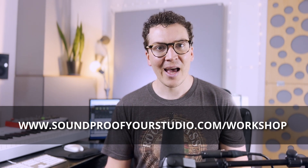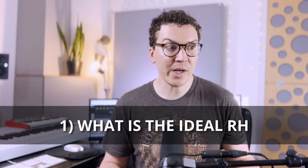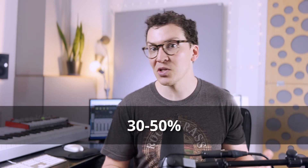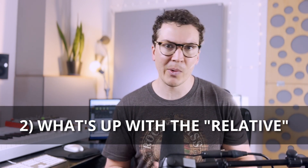The first thing we need to ask is: what is the ideal relative humidity? The answer is a little contentious, but in general it's safe to say that between 30 and 50% relative humidity is ideal for both comfort and safety — so you don't get mold growth or water running down the walls. You may be wondering what 'relative' means in relative humidity, and the answer is actually an interesting scientific reason you may have learned about in high school.